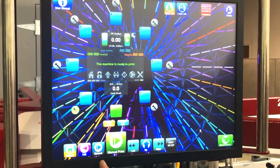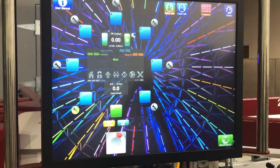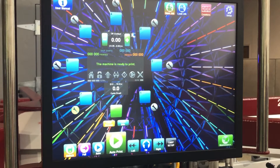Every morning our machine will start in manual mode. If we'd like to change to auto mode, all we have to do is click this button here and now we're in auto. Ideally, we want to be in automatic mode, where we're going to keep up with the pace of the machine and move at a steady pace. The machine is going to keep going until we hit the stop button. First we need to hit the start button here, and then the stop button will appear. The stop button is not an emergency stop — it stops when the machine comes to a good stopping point, completing all of its functions before coming to a complete stop.